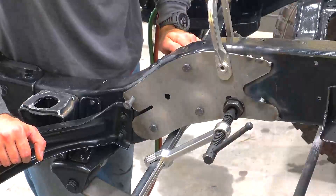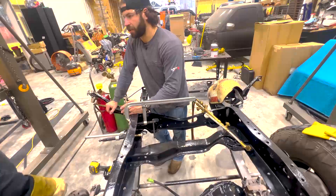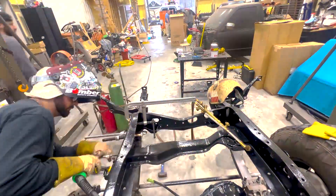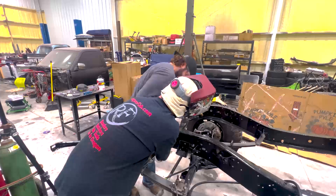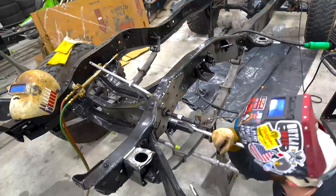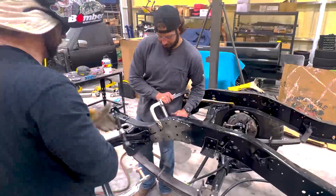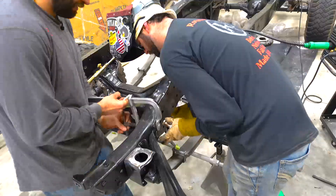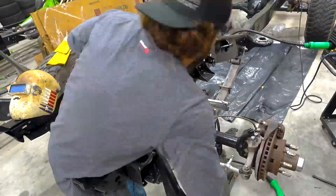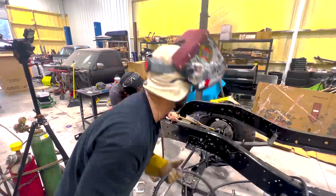These bolts are stressing me out but it's more important to get it fitted to the frame than to have the holes line up since I can drill them. We actually had a really hard time getting this fish plate on — we had to wrestle it quite a bit with these Strong Hand clamps as we worked from one end of the fish plate to the other, making sure there were no gaps between the frame and the fish plate. As we got things clamped we tacked along the way, making sure there were no spaces whatsoever. Once it was all tacked, we were ready to weld.